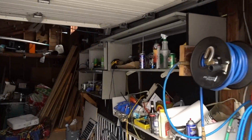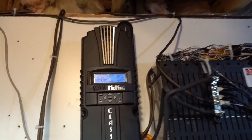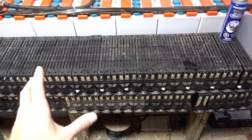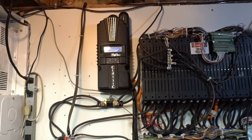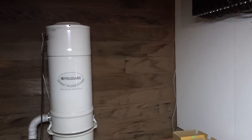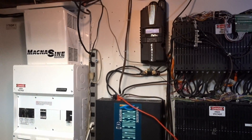Let's see what we're making — it's getting close to winter. Out of 4,500 watts of solar I've got 75 watts coming in, and 3.5 kilowatt-hours today. I still have the same amount of batteries — I was gonna hook more up today but I got onto the solar instead, since I have a sufficient amount of batteries already. What I really need is to get all the solar up so I get charged during the day. I'm also gonna have to cut vents in the wall and put a fan with a temperature controller so this room doesn't get too cold.